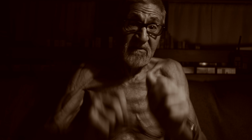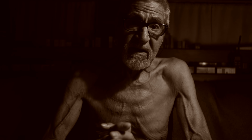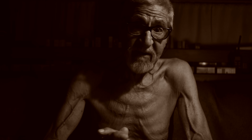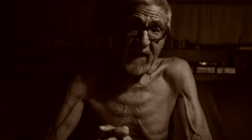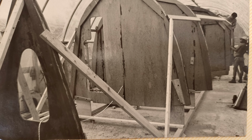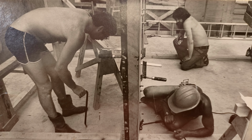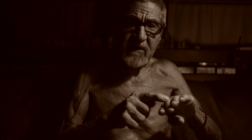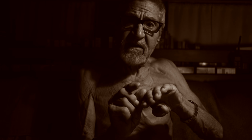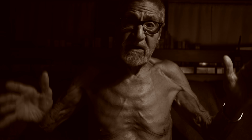This required quite a bit of muscle because the big bulkheads are very, very heavy by this time, so it was a perfect occasion to invite all my friends on a Saturday as usual, and they came out and we did the chore. We placed them precisely on these marks, and braced them with 2x3s and 2x4s to each other with staging nails. Staging nails are temporary nails. They have two heads. The one head holds the lumber as a conventional nail does, and the second head protrudes to allow a claw hammer to pull it out. So now all the bulkheads and the transom are put into place.